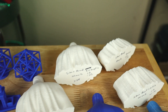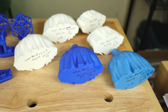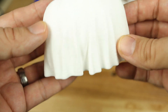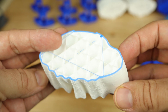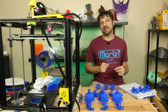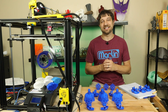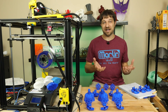I kept trying — I turned all of those advanced features from the configuration_adv file off, but still no luck at 100mm/s. I tried S-curve without linear advance, and that's where all of these Batman busts came from. I also tried the Marlin 2.0 bug fix branch — that didn't change anything. I tried an older version, Marlin 2.0.4.4 — same sort of deal, no luck. So at 100mm/s without any tuning, I am not able to get Marlin 2.0 — whatever version — to print acceptably.